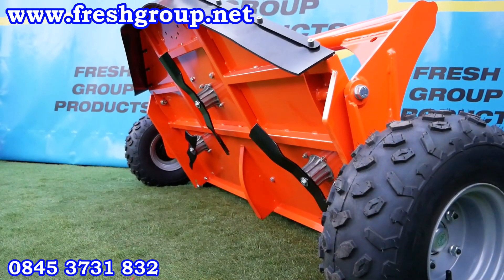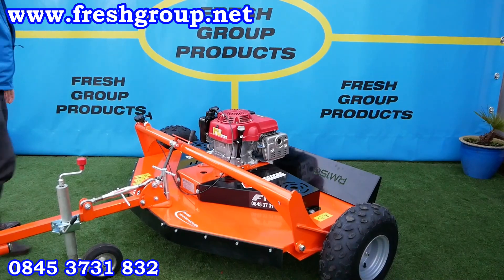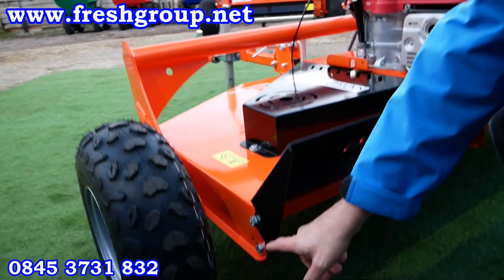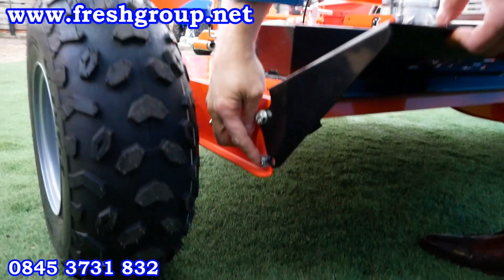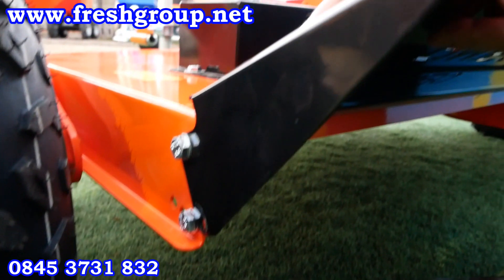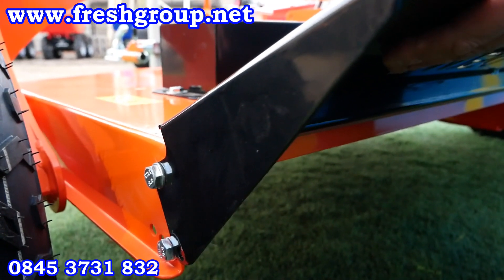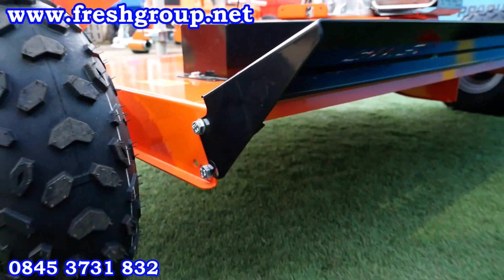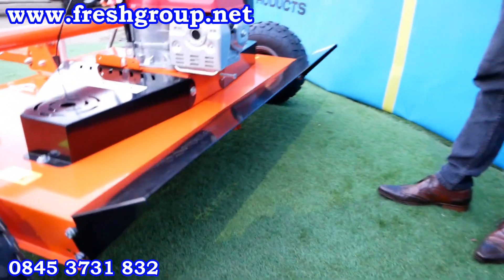You'll notice a little front skirt on the front here just for protection. Going around to the back edge, you'll see the rear deflector. There's a bolt that you remove to set its position. I personally recommend to all customers — unless you need to deflect, for example when mowing near schools or glass — to have the deflector in the horizontal or fully up position so that grass and vegetation can eject as freely as possible. That's the best setup for general paddock topping. If you're around buildings and might be picking up stones, then you put the deflector down to protect against any damage.